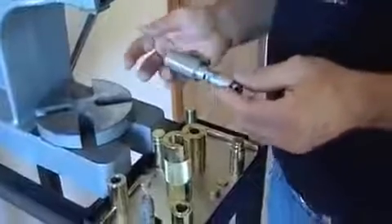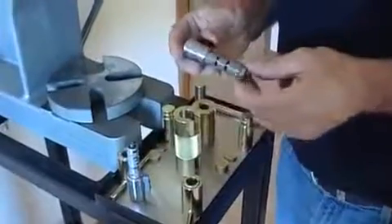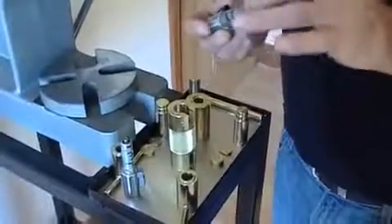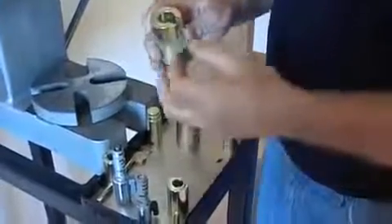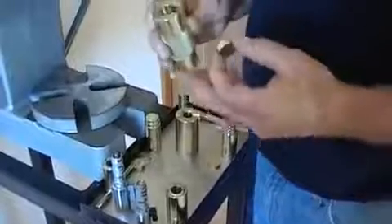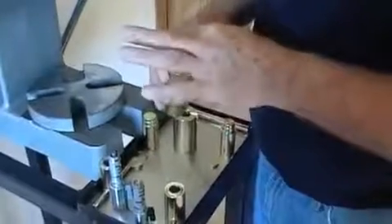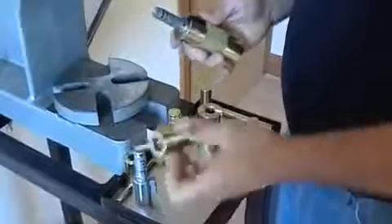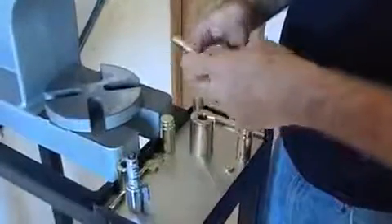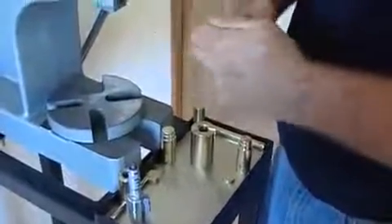The larger version is very similar to what we're used to seeing with the earlier kits, so I'll focus our attention on the smaller version, which has some subtle differences. The holding fixture now covers both types, but the way we open and close is fundamentally the same as the previous kits. We start with spacer 1A in holding fixture number one, insert the small solenoid, and using the smaller opening tool, we peel back the solenoid as before.